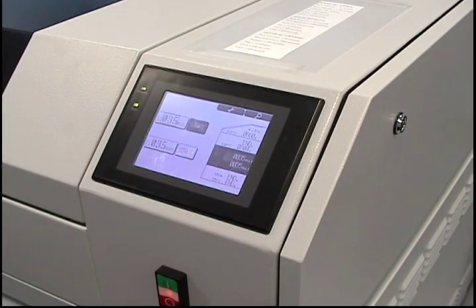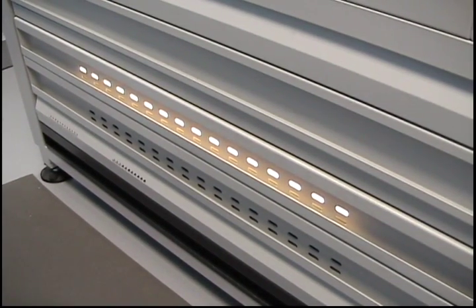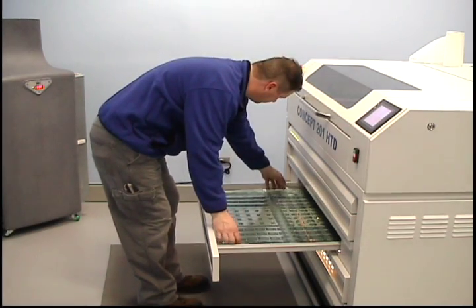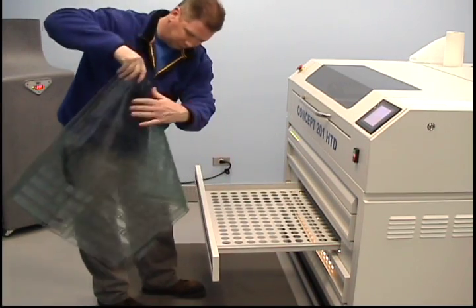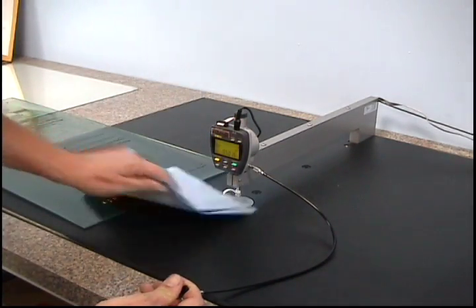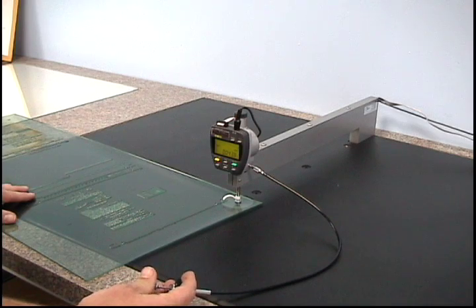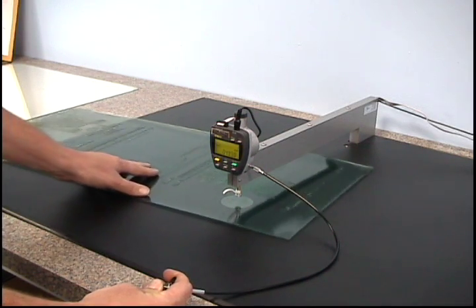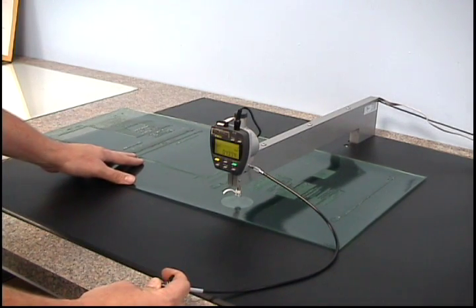Minimum dry times are established to bring the plate back to its original plate thickness. Once the drying is complete, the material should be miked again to check the finished material thickness. It is important to check both the floor and face thickness in multiple locations around the plate. By checking the face of the material, you can make sure that you have not over or under dried the plate as compared to its original plate thickness. By checking the floor, you are able to establish whether you have the correct plate relief.